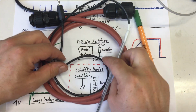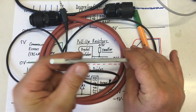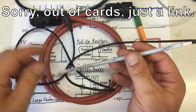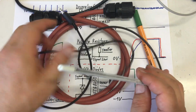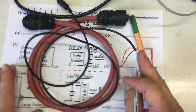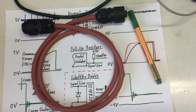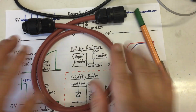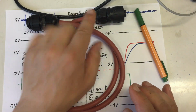Let's talk about the elephant in the room. I always had that third DS18B20 temperature sensor attached, nicely installed in this glass tube, which I melted shut, so I can put it into the etching solution, and it's attached to the controller by a 1 meter signal cable, made to carry signals. And we never had problems with that one. The other 2 sensors in the water bath itself, which gave us so much trouble, were also connected by just 1 meter of cable to the controller.